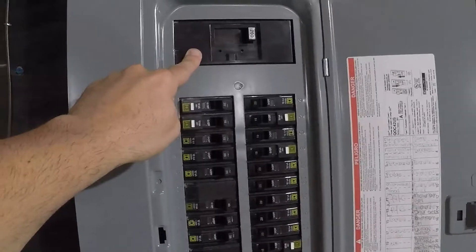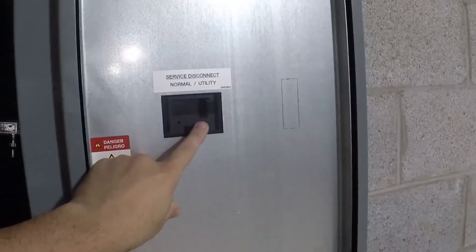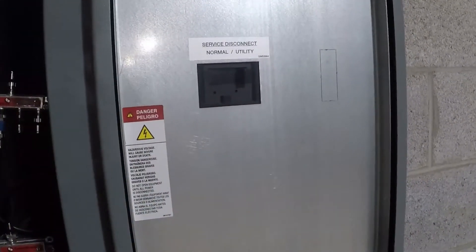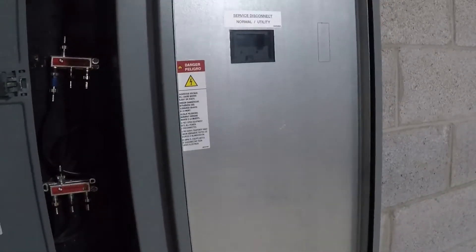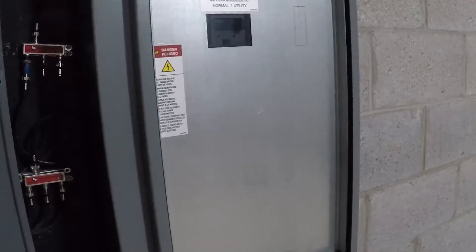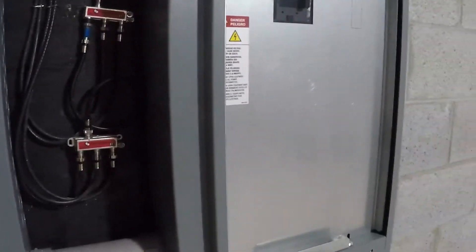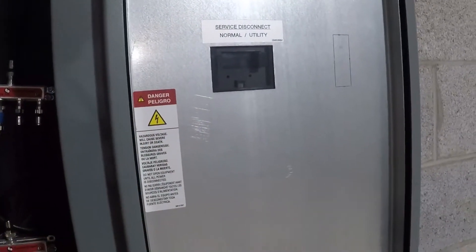For anyone familiar with electrical systems, you're going to have a main breaker for the house. This is a 200-amp service panel. This 200-amp main breaker will manually pull the system off of utility power, and when the automatic transfer switch detects that, it will then start the process to go to emergency backup — fire the generator and repower the house. So basically the main breaker in the service panel becomes redundant at that point.